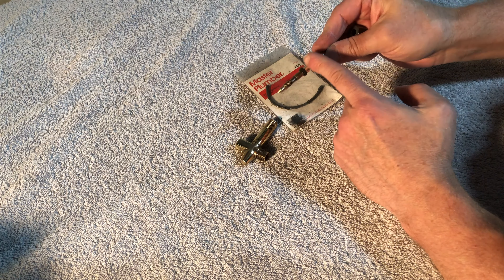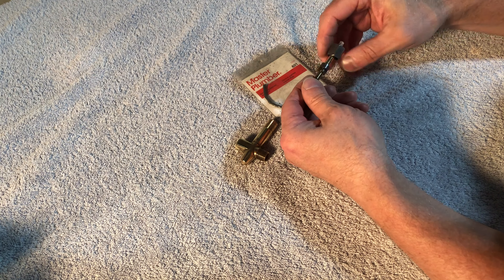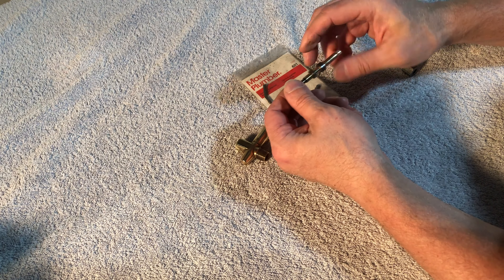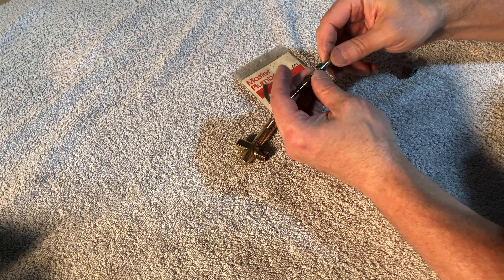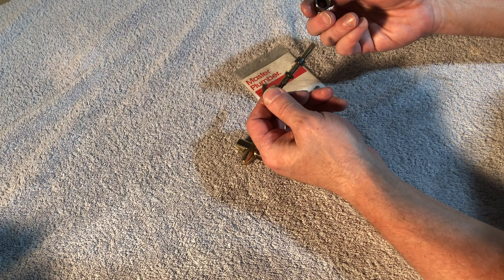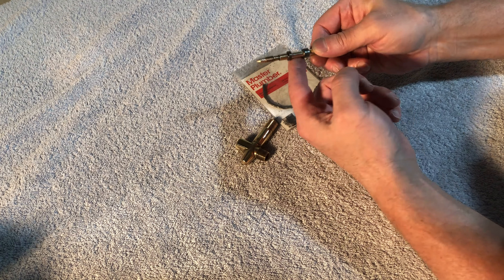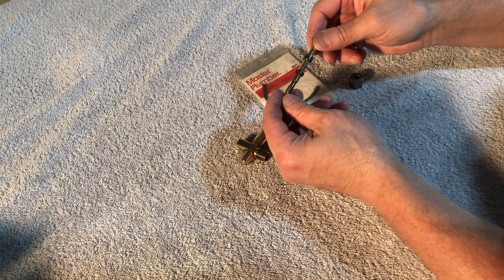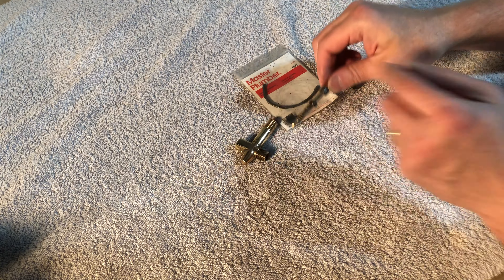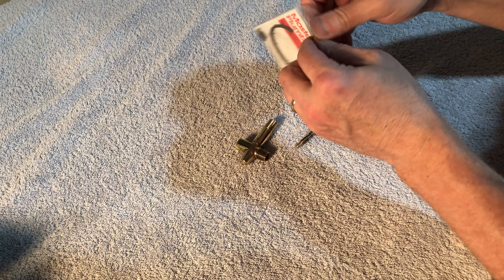What you're doing is you have some kind of graphite cylinder or rope stuffed in between here, and when you tighten down this nut it's tightening that graphite — in this case between these two pieces of steel — it squishes it out and that creates the seal. And of course graphite's slippery, so it also allows the valve stem to turn. Now sometimes the graphite packing just breaks down. I had another 220 a number of years ago where the packing just came out as a bunch of dust basically. Other times the packing gets sticky and it's really hard to turn the valve stem. The other thing that happens is sometimes they just start breaking down and they leak. So sometimes you have to replace these. It's not the most common thing, but it does happen with some frequency.